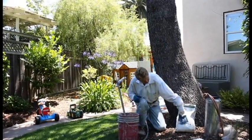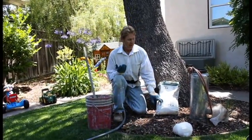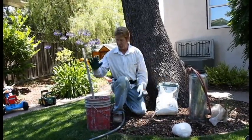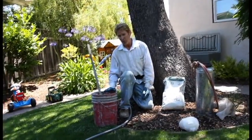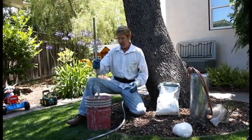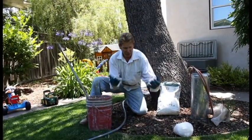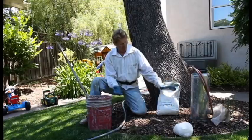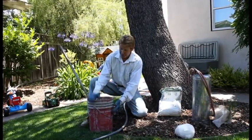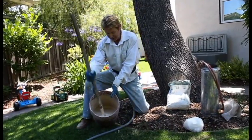Fog coat is bags upside down. You get the same color as the color you used. I only used half a bag, so I've got this much in my bucket. If you use a whole bag, you fill that bucket up with five gallons of water and slack it. Slacking means you let it sit for about 10 to 20 minutes. Then on a whole bag, you pour five gallons into another bucket, so you end up with two full five-gallon buckets. Because we don't need much, I've only used half and I'm going to fill this bucket with water since I've already slacked it. This is called slacking — right there where it looks like putty.